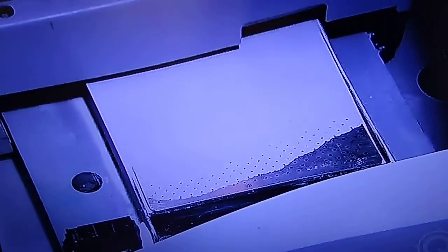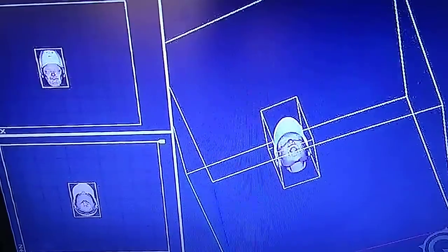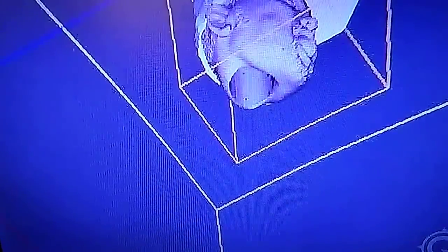The printer looks like an ordinary inkjet printer you might have in your office. Except this printer can actually print in 3D to make a three-dimensional prototype of the bobblehead. It works by binding together tiny layers of gypsum powder to build up the form. To start this amazing process, the computer sends coordinates from the 3D sketch of the bobblehead into the printer. Those coordinates tell the printer where to build up the layers of powder.